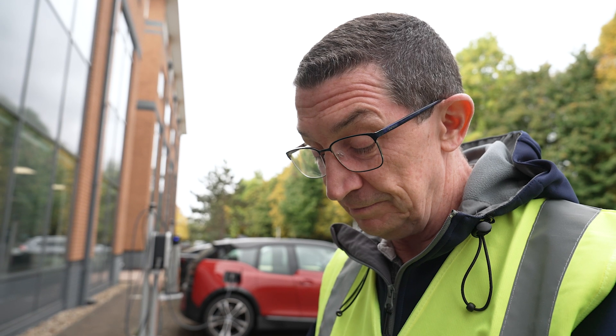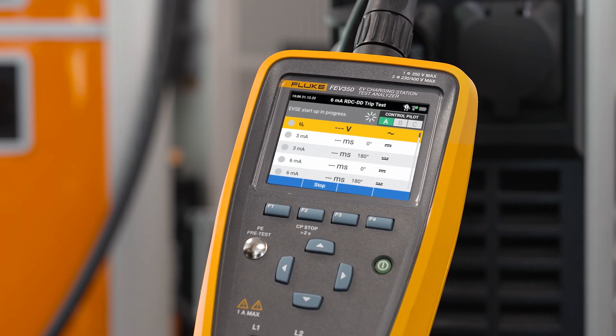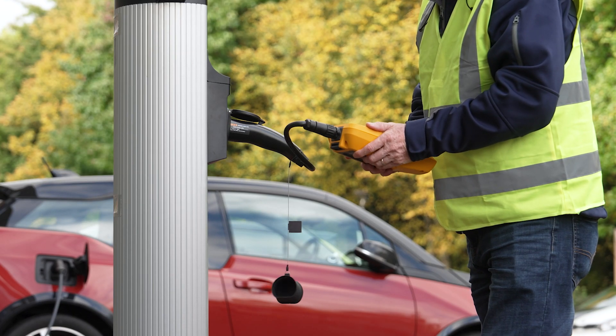Next, select the RDC DD test. The FEV350 will perform a 6mA DC fault current test, ensuring that your EVSE can detect and respond to any DC leakage currents.